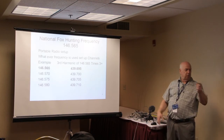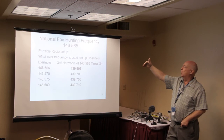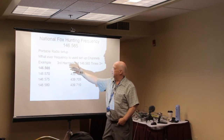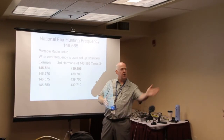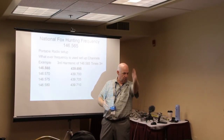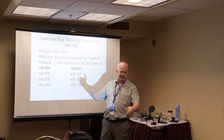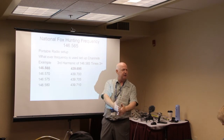Like this, we talked about before, these are the fox hunting frequencies. That's national. So there are ways of looking at it. We set up the radio with the fox hunting frequency, and you start off at a distance away. Okay, I have a direction where it is, I'm going there. It gets stronger and stronger, or it gets weaker, and you take a right or a left and get yourself lined up to track down that signal.